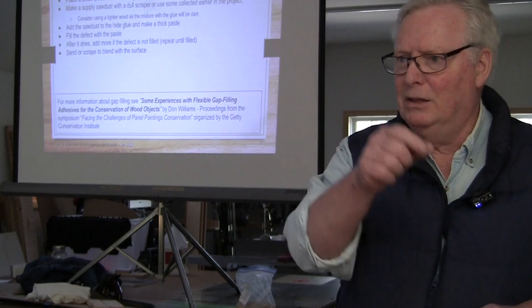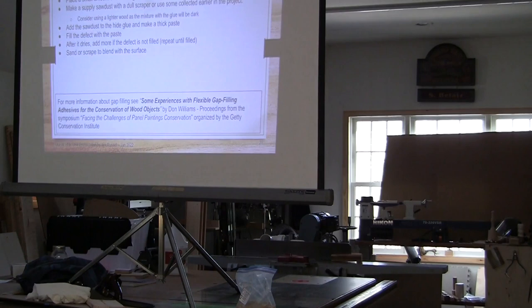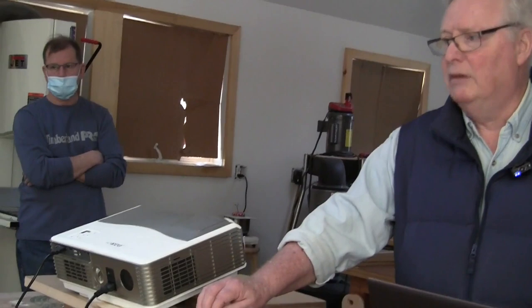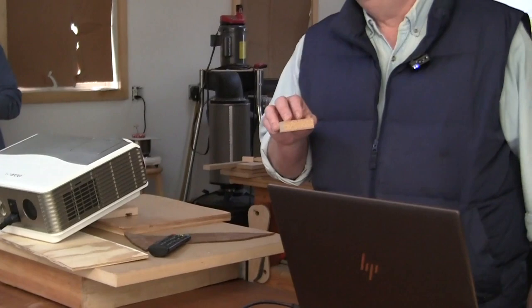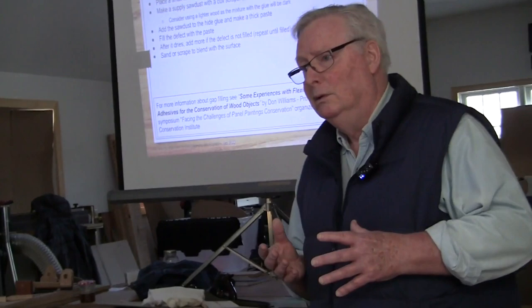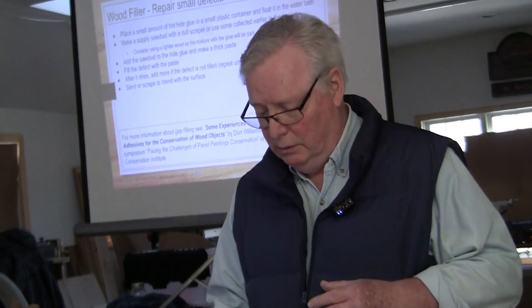over that drill hole, then you go to a separate piece of the board and do it again, and take the piece you just carved out and put some hide glue down on that spot, then put the piece you just carved out of the other piece of the board in. Take a piece of melamine or anything, wood with wax paper, and put it down on top of that, clamp it down for 15 minutes, and then scrape it. You'll never see that. And if you tried to fill that hole, it will always look like a circle was filled with something. It's just impossible to get rid of it. So sometimes creating a bigger hole is the solution, and the hide glue is good because it's not going to affect the finish and it sets up pretty quickly.